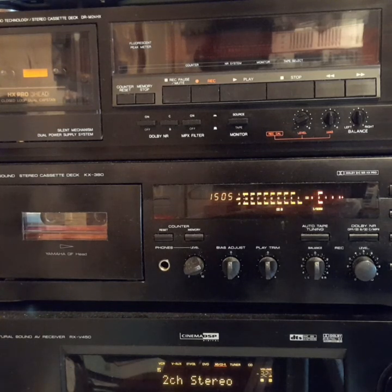There's one more noise we might point out, and that's mains hum. You're listening to an example of it right now. It's caused usually by an earth loop somewhere in your system, and you'll find some advice on how to get rid of it in the notes.